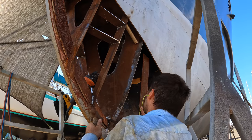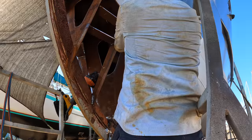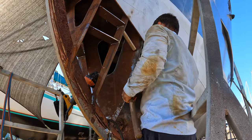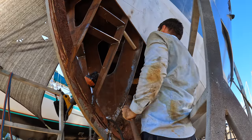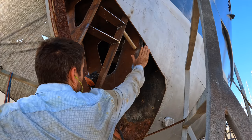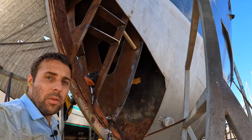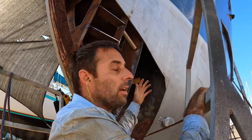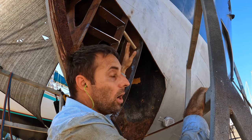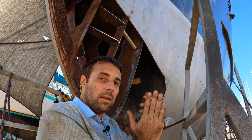Here's a straight edge I prepared earlier. Little bit more. Perfecto. So it's the right physical location in this dimension here, but the hull has buckled out slightly. There's a bit of a wobble going on in the hull plate, which is to be expected when we take all of the strength of this bottom plate out. So what I need to do now is pull this hull back into the plate, keep the plate where it is, so I'll tack it at the top, and that'll hold it in its location, and then use dogs to pull this in and get it exactly where we need it, up tight against that bulkhead, and then weld it all down.